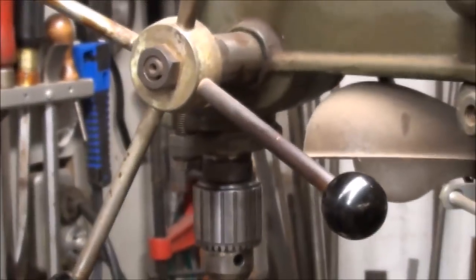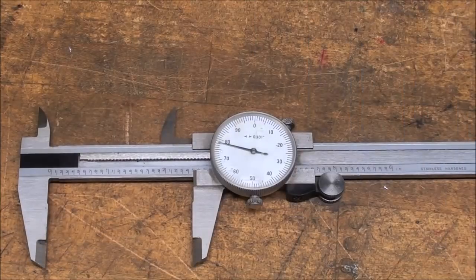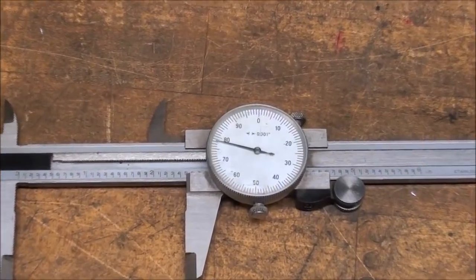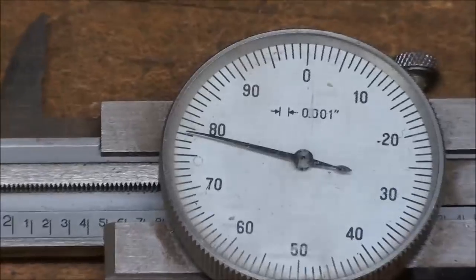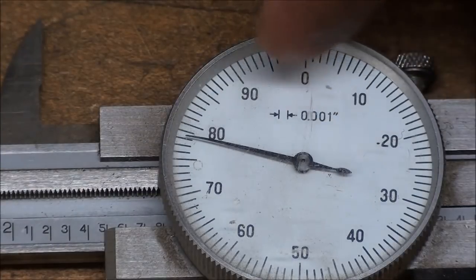Every drill press, including the quill on the Bridgeport, uses a rack and pinion. So there's a lot of applications for that. And everyone that drives a front wheel car is using a rack and pinion every time they get in. There are probably a lot of other things to see here in the shop too, but those are just little ones that come to mind. Now back to the business at hand. As I just adjusted my tripod, it came to mind that I was adjusting a rack and pinion for the height. And I also forgot to mention that on every dial caliper there's a tiny little rack, right there, and the pinion of course is the gear on the end of the dial.